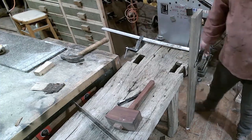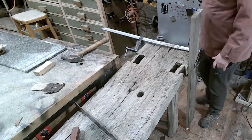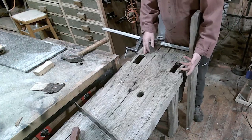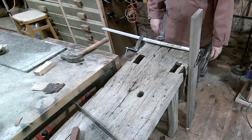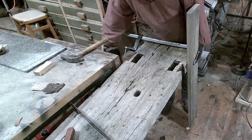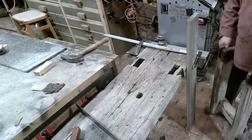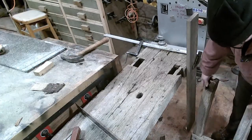Right, so it's going to be a bit of chopping, some chisel work to do. But first of all, we need to measure it because it's deteriorated differently. I can't cut these exactly the same size because it's rotted in places and a bit of worm in other places. So I need to make it a bit smaller to compensate, and then a little bit of TLC so it actually fits. Then I'll put some wedges in to hold it in place. It's a bit manky on the ends of that, but we don't care. It's just got old nails in the bottom holding that ledge on.